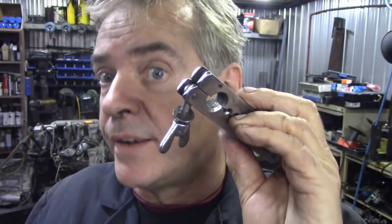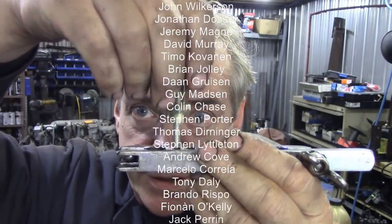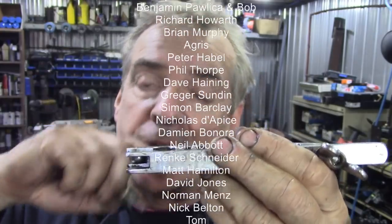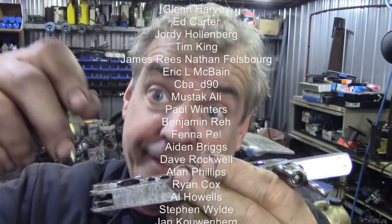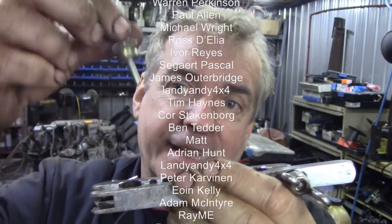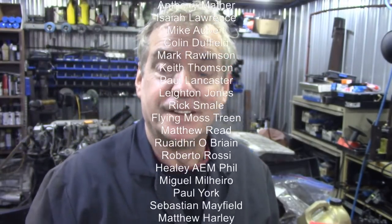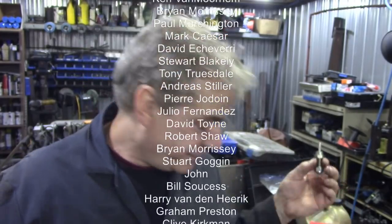Now I had 3 experiments with this. Once I warmed it up too much, and as soon as you hit the pipe square, it just bent. And then I did it when it was cold, and it just cracked the pipe. Then I warmed it up so it was just warm to touch, tap this in, perfect. That's what I liked. That's my standard. So you can do it. So that means you can mix and match all sorts of stuff kicking about.